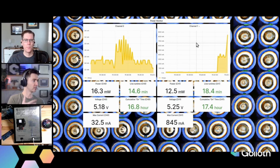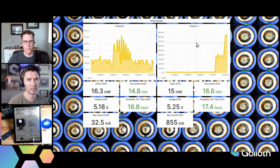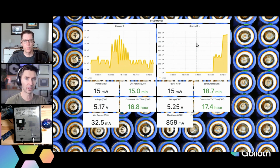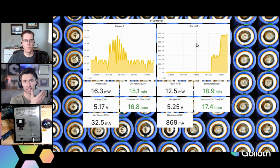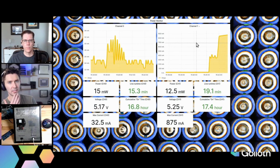So this is taking your reading, I think every 5 seconds or so, and sending it back to the cloud. It's not going to have the spikiest readings that you might get if it's something like the dev board on the left side, where channel 0 is the instantaneous current it's drawing. You might not see when it's trying to reach the cell network, which would be a very spiky current thing. You need a higher, more precise thing for that, more resolution in your readings. But for something like LEDs, or like you're charging a bike, like Mike said, it really does show you cumulative energy, because you can rely on having this relatively consistent power for something like LEDs drawing over time.